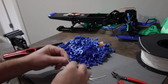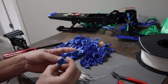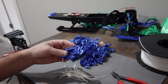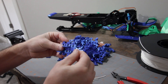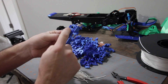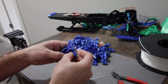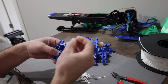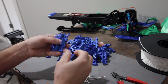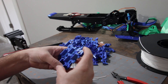I'm back and I've got a whole bunch of these pins cut. So once you get to this point we can start putting track together. You're going to do a double paddle and a single paddle — they should just line up like that. Then take a pin and just work it in and it should go flush. If you got your length correct on all those it should go flush. You can go ahead and just start putting these all together.